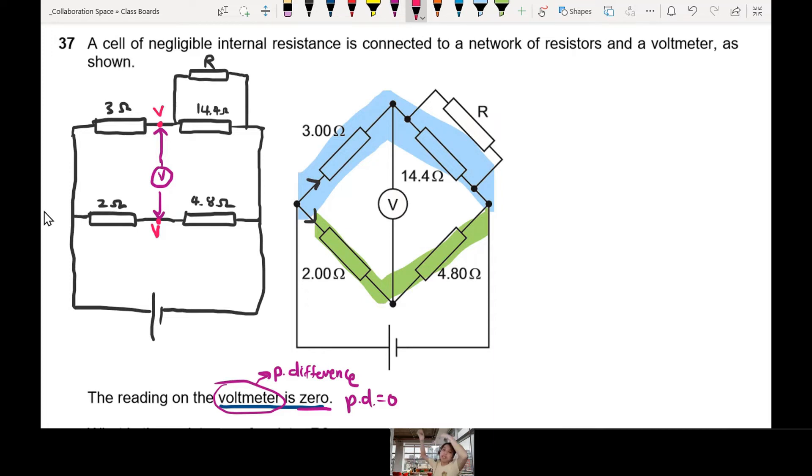Here's an example to understand what 'potential the same' means. Let's say the battery has 12 volts. The potential coming out at the high point is 12. Then, if I drop down by a certain value — say I drop by 4 volts — 12 minus 4 becomes 8 volts. So this node is 8. If I want the other side to have the exact same potential, I also have to drop by 4 volts. So 12 minus 4 also becomes 8. Both sides are 8 volts, so what the voltmeter measures is the difference: 0.